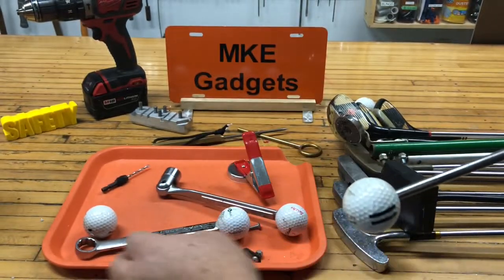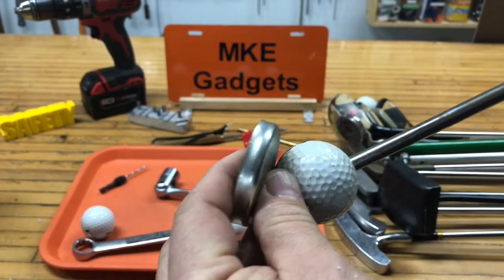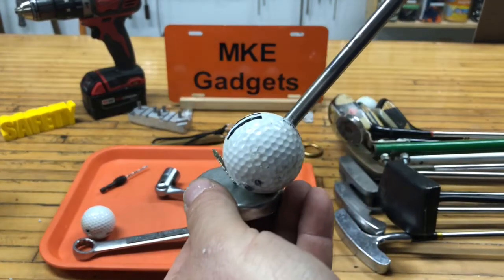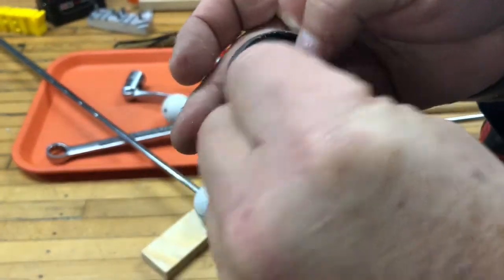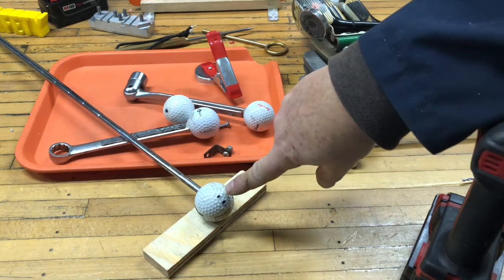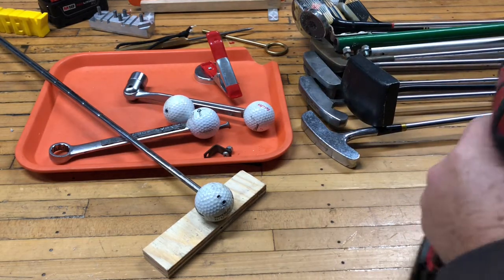So next we gotta take our magnet and find the angle that's comfortable so when you're walking, this is on the ground. I'm using a 1.5 inch deck screw. I pre-drilled it with a 1/8 inch pilot. You can see I have 2 holes because the first one wasn't at a good angle, and the second one, that should just work fine.